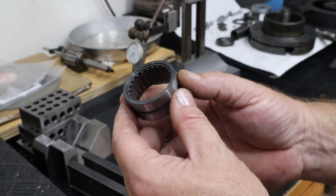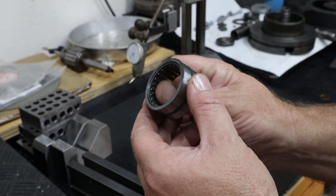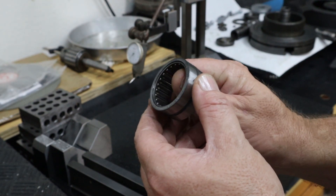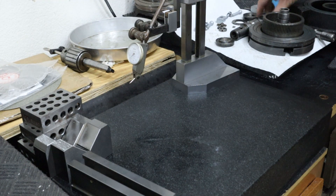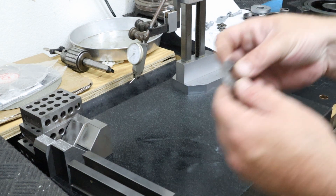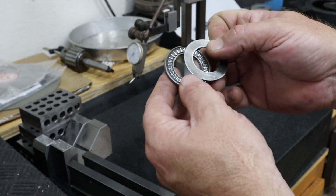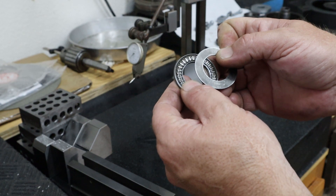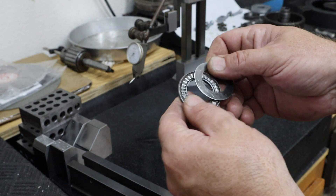This bearing had a lot of old oil, but it now freely turns. We'll be lubricating it with just a light lithium grease. Same thing with the back thrust bearing - that pulls the table down into the whole device. This wouldn't turn before, but now it turns nicely.